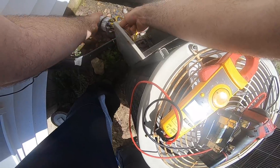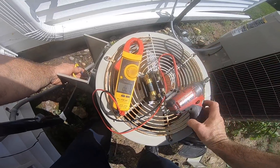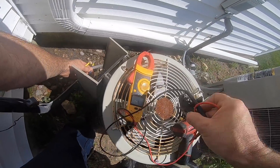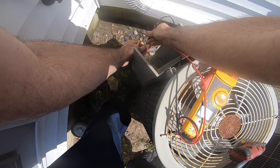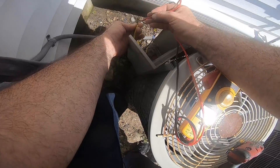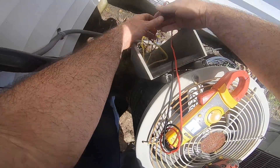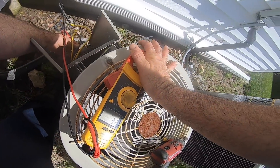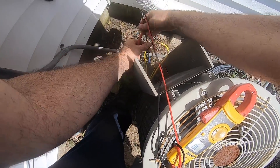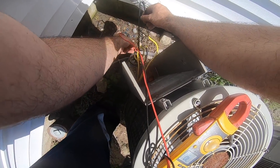Compressor wire - make sure I got continuity. This guy burned up a little, look at this some burnt stuff, but he's good: 3.1. Now the black one - 2.8. Yellow to black - making me think my compressor is good.